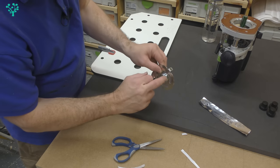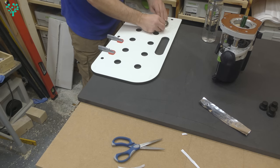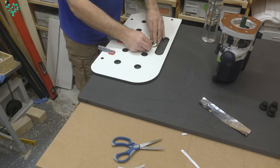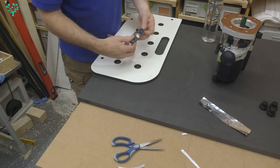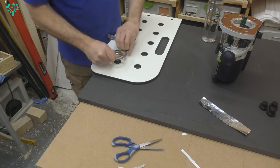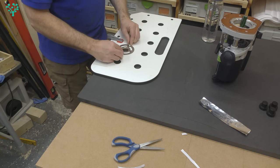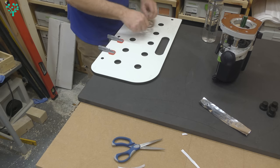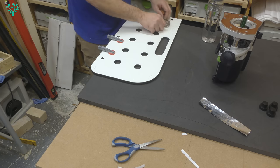What that's done is made the bush a little bit thicker, so now when it goes in it's a firm fit with zero wobble — and that's what you're looking for. I'm not sure whether it will wear as we go through the job, but it seems okay. That's now taken out any slack in that bush whatsoever. Worth noting: that was a Festool bush, precision-made, yet I still needed to adjust it — fiddly, but it works.